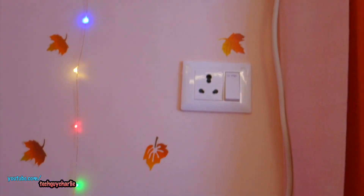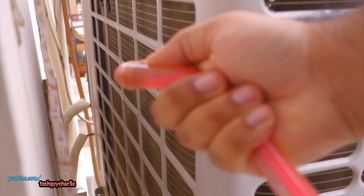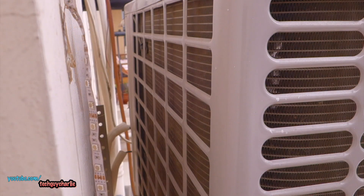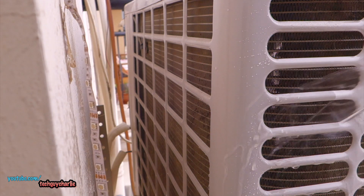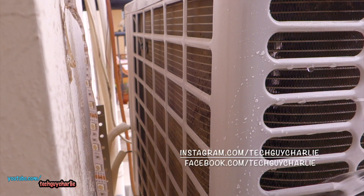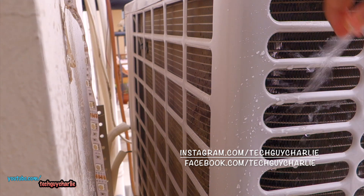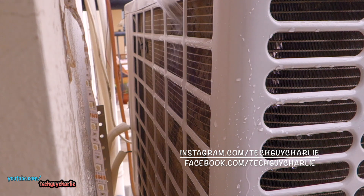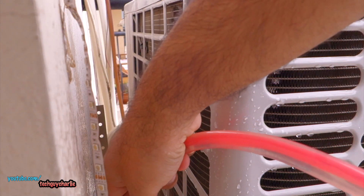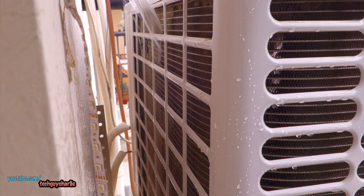You can use plain water to clean the condenser coils — I'm just using the garden hose and spraying water on them, which should bring out all the crud and dirt. I've been doing this for many years to all my air conditioners at home. You should always do this yourself; don't waste money calling a technician — do it yourself and spend that money on pizza instead.